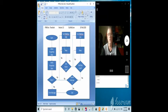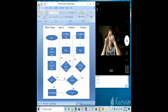Now the reason we're looping this is that sometimes with some chips, the sleep mode doesn't last for as long as we need it to, and we need to add a bit on. So we keep putting it back to sleep until our cycle finishes. And when we hit the end of that, we go, oh, okay, we hit the end. Now what we need to do is turn the pin off. So we've got our high, now we've got our off, and we're doing the same thing. We're going to sleep until we hit the end of that.